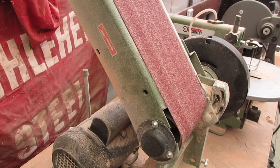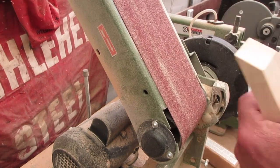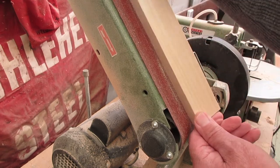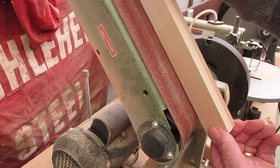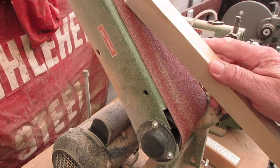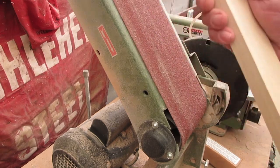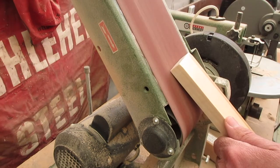Okay, now as usual, we'll make sure my belt sander is nice and clean, and then I'm just going to run this up and down and do the same kind of thing we did on the neck. Tilt this back and forth everywhere, and then round these corners off like this and like this. Make sure everything's nice and smooth. I'm going to do this in separate clips so you don't have to listen to the noise.